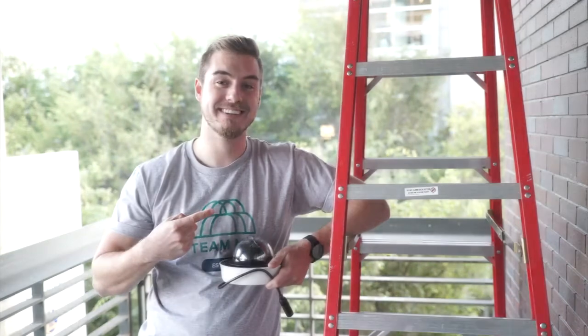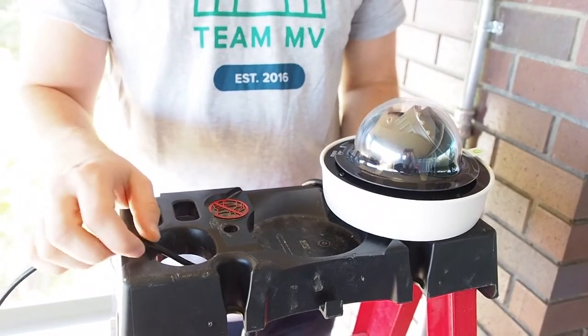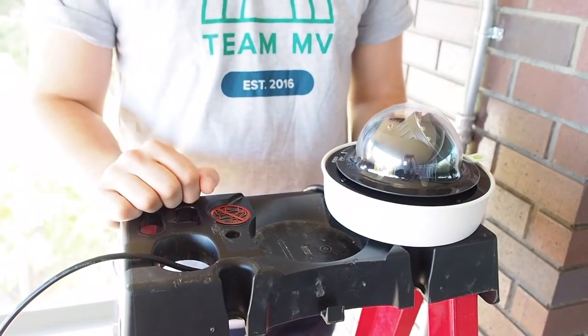Because this is an outdoor camera and a lot of you will probably be installing it on a ladder, I'm going to do the same thing right now and install it on a ladder, just like this one. For this procedure, it's important not to use a booted patch cable as the pieces just won't fit. Second, make sure you've got a spot to place all the small loose parts of the gland, like the ladder tray or a shirt pocket.